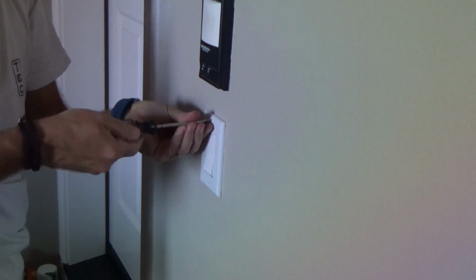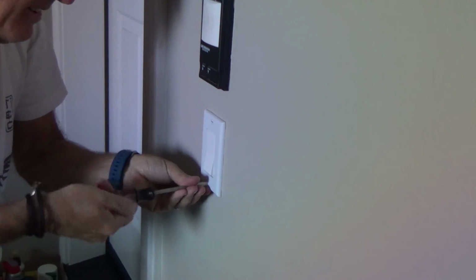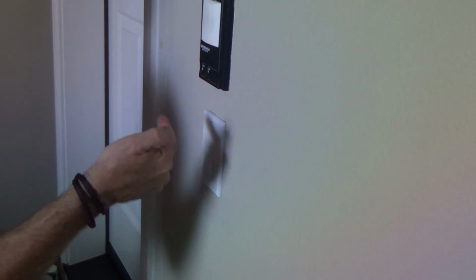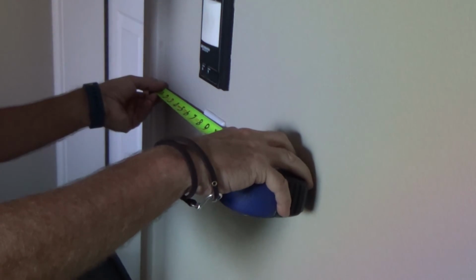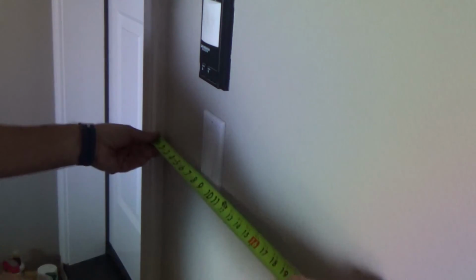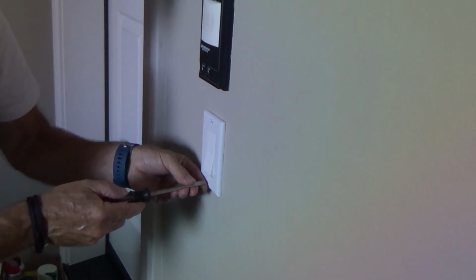And then say, well, it's not perfect, but it's as close as I could get it. And make that snug. I look at it, see if the top still needs to go that way a little bit. And I can confirm that by measuring this. I got 7 1/4. And just, well, it looks pretty good actually. 10 1/16 to the right, 10 and almost a 16th to that right. But it's still, right there, it still slightly looks crooked.